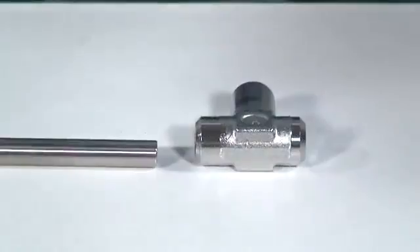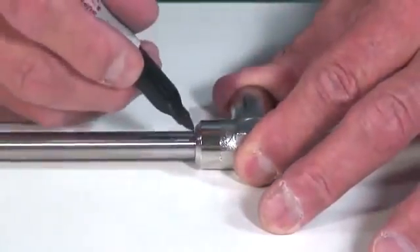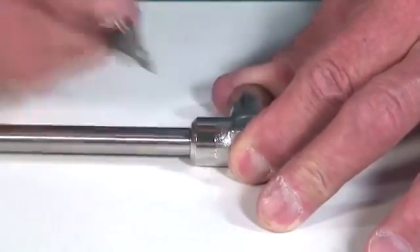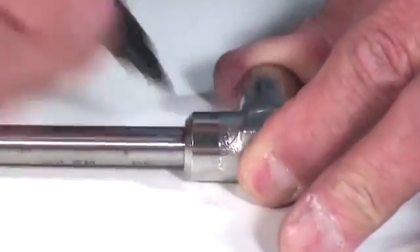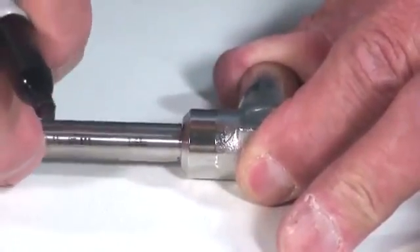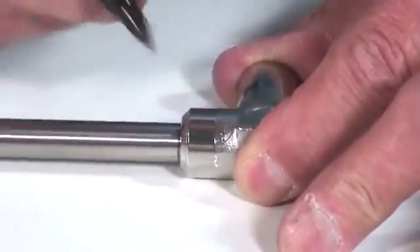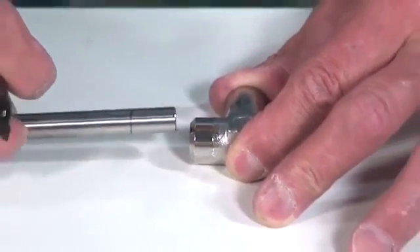To create the validation line, insert the tubing end completely into the GMT until you bottom out the tubing. The sizing angle in the fitting itself will remove variation for the various tubing diameters available, as not all nominal tubing has the same OD. With your permanent marker, mark the tube around the complete circumference at the point where it just emerges from the tool. Remove the tube from the tool.